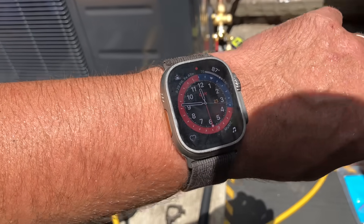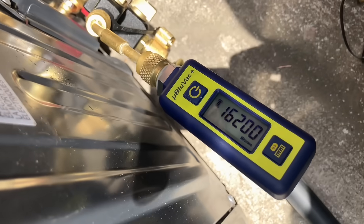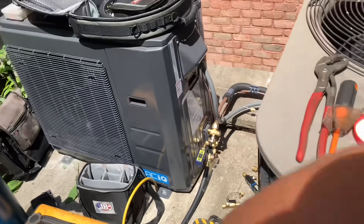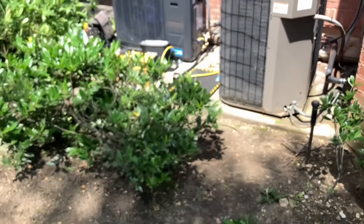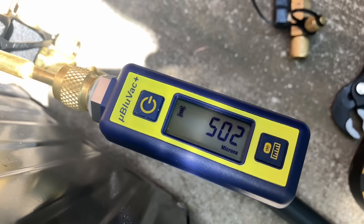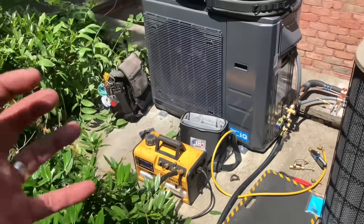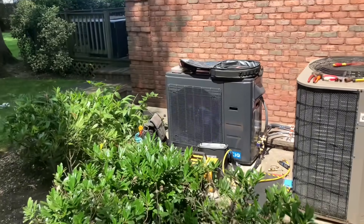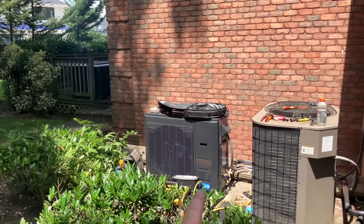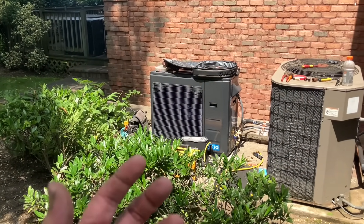It's 11:46 and a half. Let's see how this does — it's been about a minute. We're at 16,000 and dropping. Time to get hydrated. It's a minute to 12 here in the great state of New York. We are at 504, 503, 502, 501 — boom! We're at 500 microns and still dropping. Yeah! It's really embarrassing how many people who claim they're HVAC professionals don't know that the minimum is 500 microns when you are vacuuming down a system.